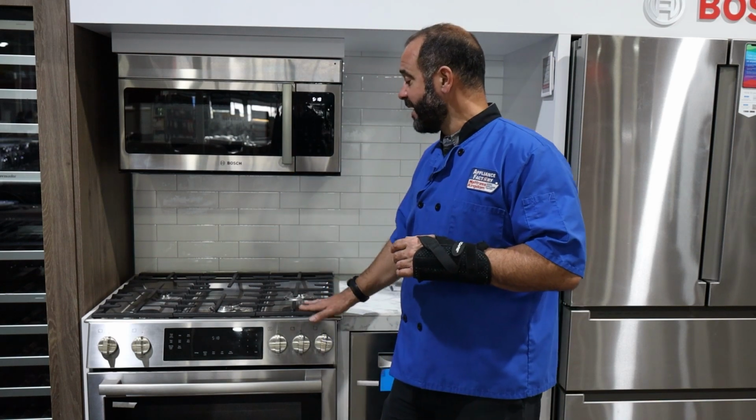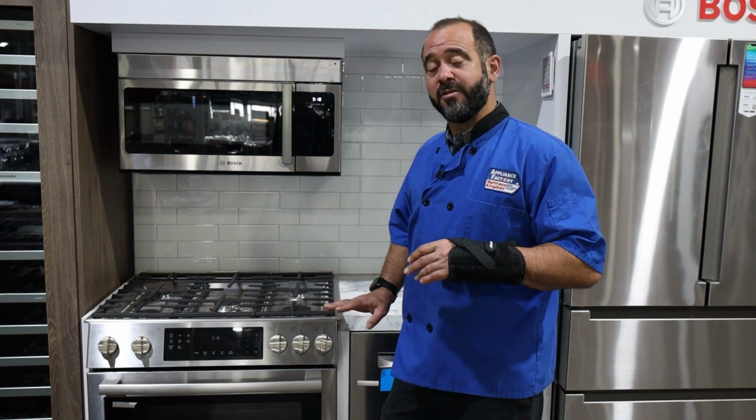That's pretty good. And quite frankly, that's usually the minimum requirement if you have a gas range, 300 to 350 CFM. There are some calculations on how much air you need to move depending on the size of your range. And I'm not going to go into all that. It can get complicated. But what I do know is more is usually better when you're talking CFMs.